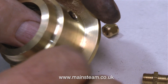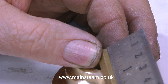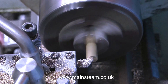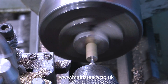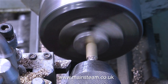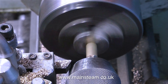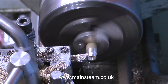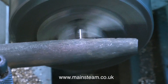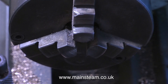Now let's look at the boiler top fitting. This is going to have a superheater element — a bent loop of copper pipe — and I need to make the fittings that will take this copper pipe and allow me to assemble it inside the housing. I'm machining some hexagon brass bar — brass, because it's not being connected to the boiler. First I centre drill the end, then machine the outer part to 5/16ths of an inch diameter, then thread it 5/16ths by 32 threads per inch. I've parted off the piece, and this clip shows me using a file to clean up the sharp edge. Filing in the lathe can be very dangerous — please do not try this at home.